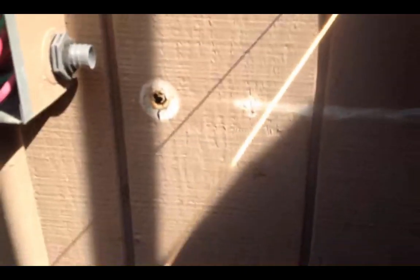Now you can see the string has come through, and there is our baggie out of the pipe. Shut the vacuum off, untie your string, then tie all your wires together, tape them, and pull them back through the conduit. That's the easiest way to wire through conduit — hope you guys enjoyed it!